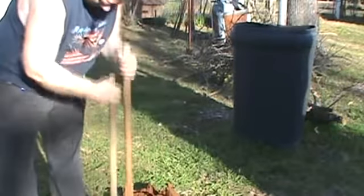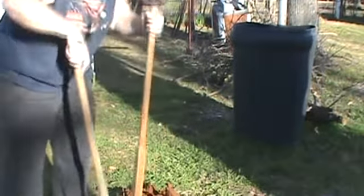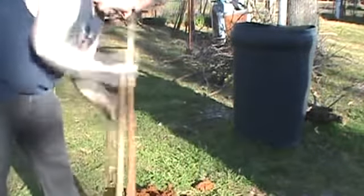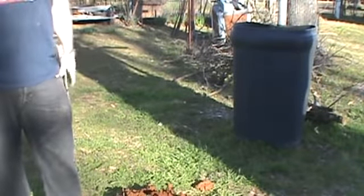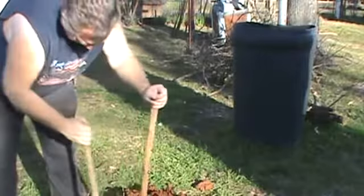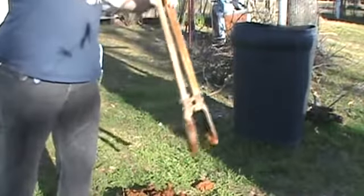And use that mud pump and get some, whatever they call it, it's something like concrete in a bag. I can't ever pronounce the name of it, but bentonite. That will harden up your sand so it doesn't cave in on you, so you don't have to have a well screen. I mean, you probably could still use a well screen if you wanted to, but I don't think you'll need it. And then you can use gravel at the bottom of your well pit. Oh, probably, I don't know, maybe 6 to 8 inches. I'll just have to read up and see what they say about that.